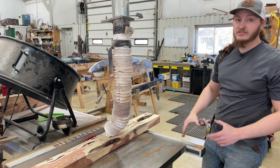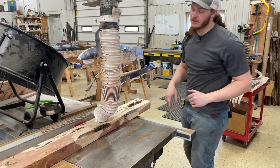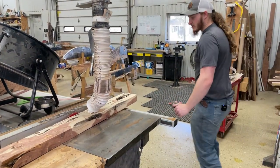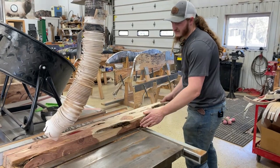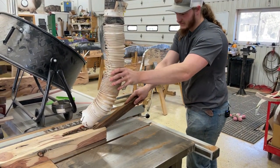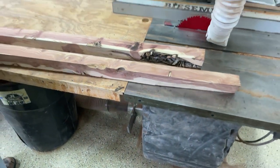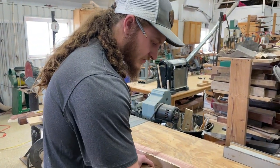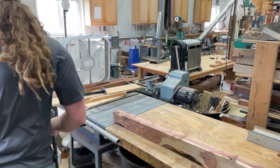When we're cutting this, it's really twisty, so it wants to grab onto that table saw and give you some serious kickback. We'll open up our dust collector ports and take this block off. That's wide enough to get a handful of bows out of. It's two inches because we have to take it down afterwards, but it's way too long, so we're going to square up our ends.